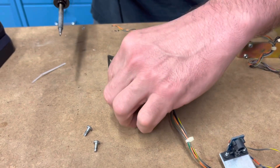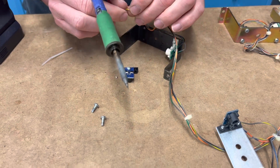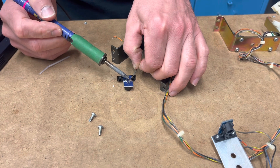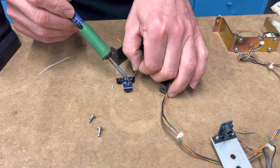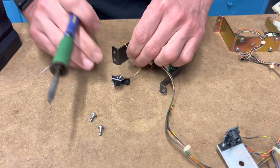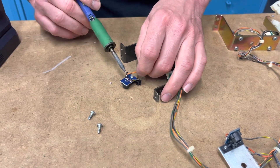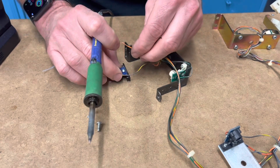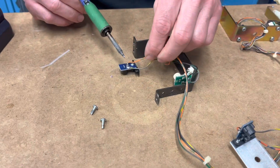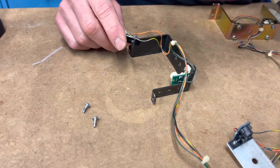On this one the A is gray and the K is black — that's a little bit easier to remember. At least that letter is represented in each word. I always have some really strange way of remembering things — not very conventional, but it works for me. I like to have a nice solid bead of solder all the way into the wire, because so often these will be frayed and real fragile and they'll just break right off.